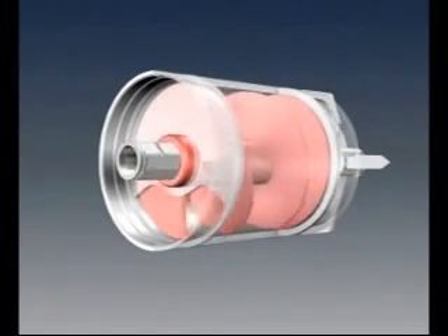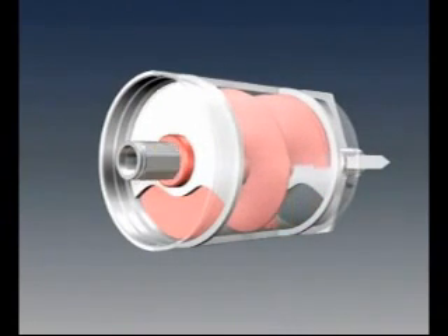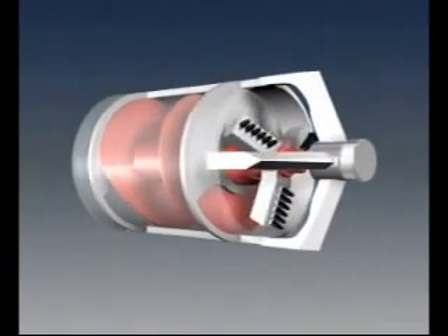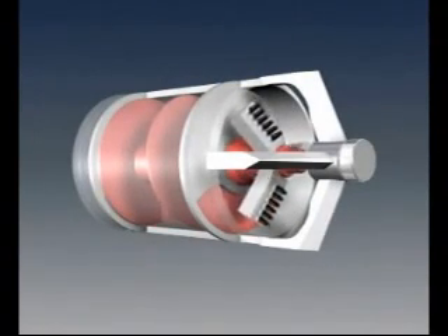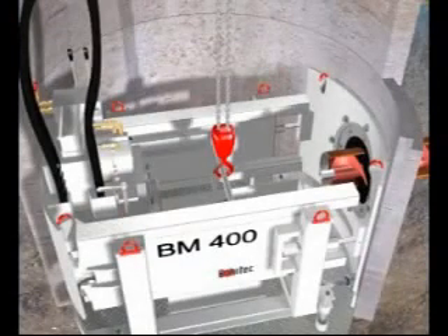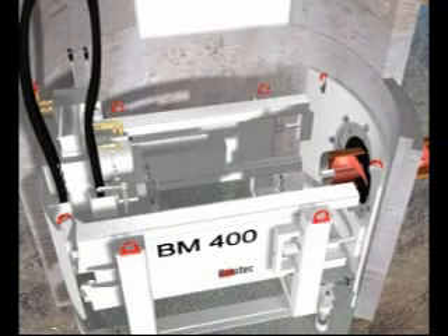In the first steel casing there are two bulkheads, each with openings in the lower area. The auger in this casing also has two bulkheads with their openings 180 degrees apart. Thus, only one pair of openings through the bulkhead walls is open for the transport of excavated material at any time during rotation of the auger. When the back bulkhead is opened, the front bulkhead is closed. When the back opening starts to close, the front one starts to open, and vice versa. The excavated material conveyed out by the augers falls into the muck skip in the working shaft. After the completion of each boring stroke, the muck skip is lifted out of the shaft and emptied before the next casing and auger are put in place.